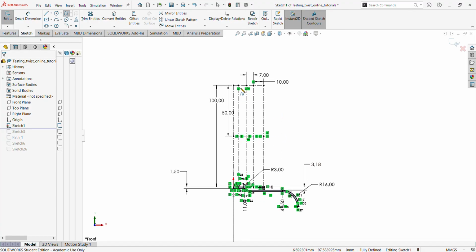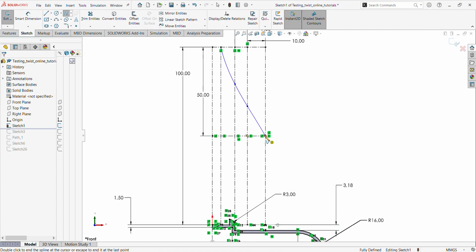So you take a spline line and then you try to intersect them between these construction lines and pass through this point, because you can see this other construction line is approximately the center point of this very design. Then you continue and terminate it at this point. Then the next thing, do a symmetry between this point and this point, so you have a pretty nice design.